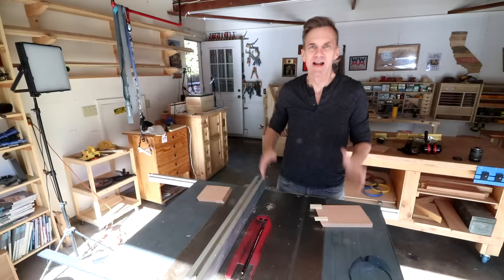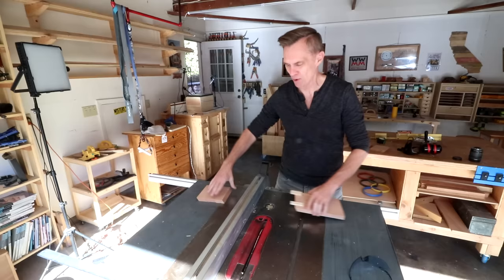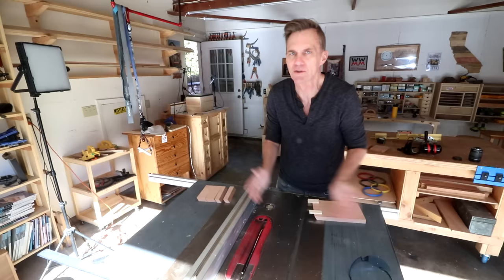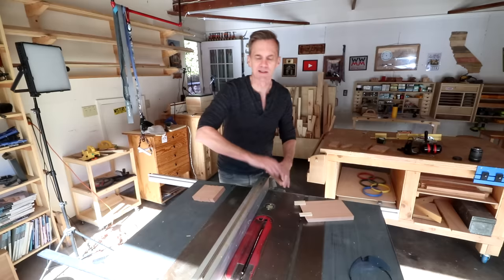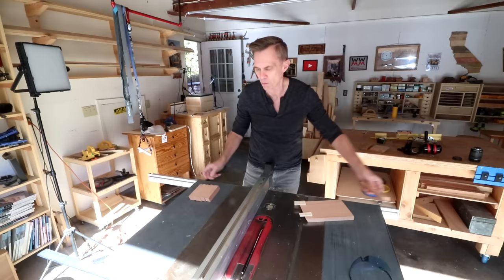Now comes the fun part. This is a lot like those snowflakes that you cut out of paper — you fold it up first and then make some cuts, and you never really know what the snowflake is going to look like until you unfold it. It's the same way with these. What you're going to do is make a series of grooves along each face of each of these pieces, setting your blade at various random angles — it doesn't matter what those angles are, that's part of the magic. You can also set your blade depth at various depths. The key to being successful is making sure you do the exact same procedure on each of the six strips, on the same face of each strip. I've lined these up so all the face grain is on top, so I know I can pass these through one at a time and make that same cut. Then I can flip it around and cut on the end grain — they will all be the same.